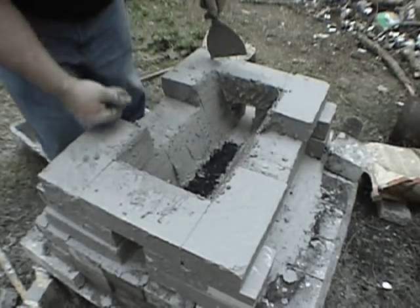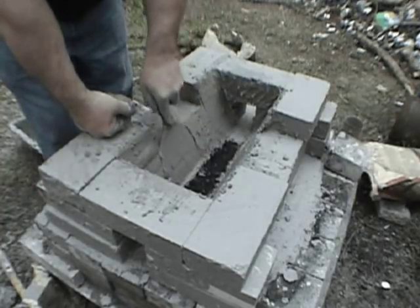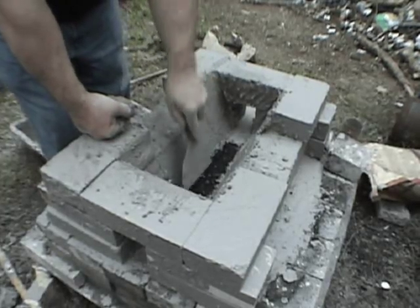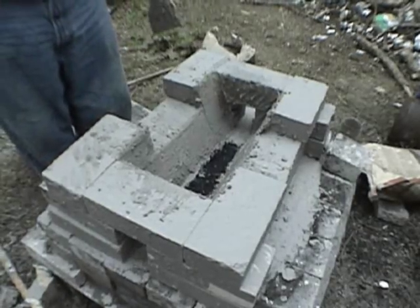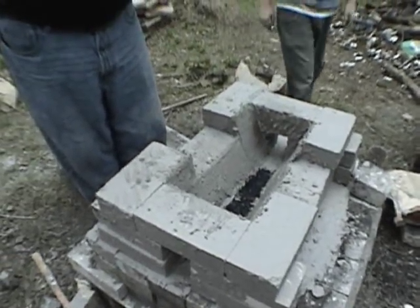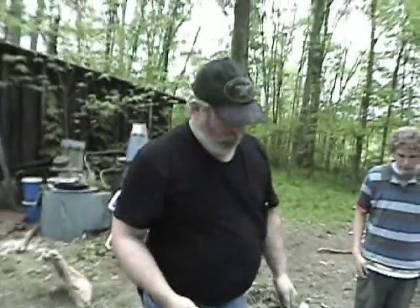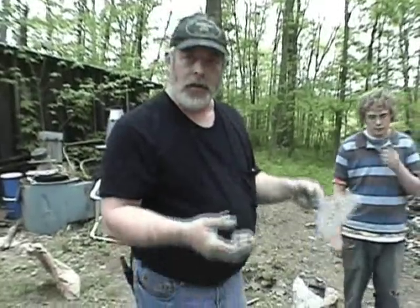What's that little bed of carbon at the bottom do? It just helps with your atmosphere? Yeah, atmosphere control for the most part. And then it'll burn out? Theoretically it's also a place for the bloom to expand. This thing's going to want to get bigger, and if it gets bigger upward it can block off the tuyeres which come in through this hole. So we give it a place that it can burn down into — as it gets bigger, it's going to get heavier and sink further down into the fire.